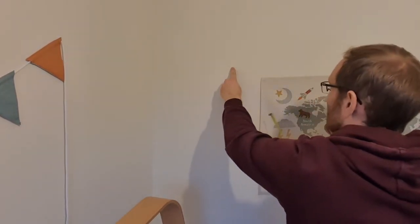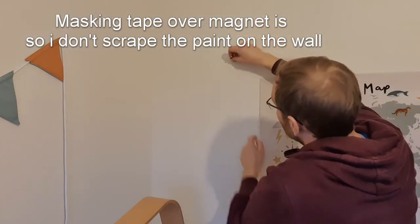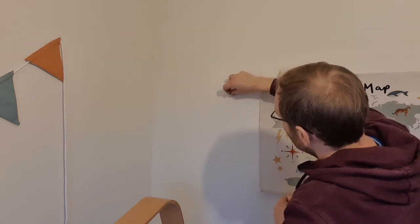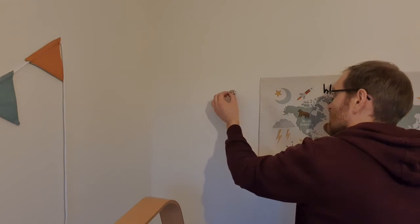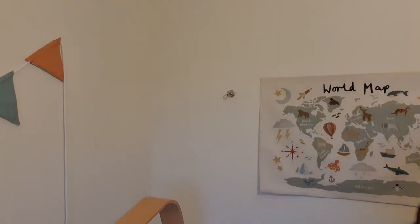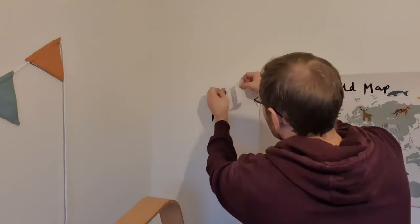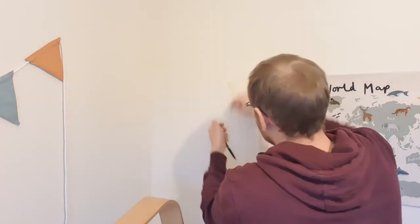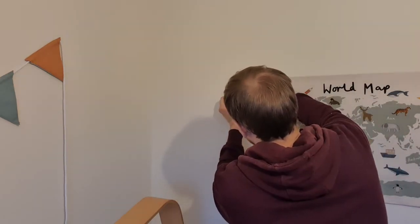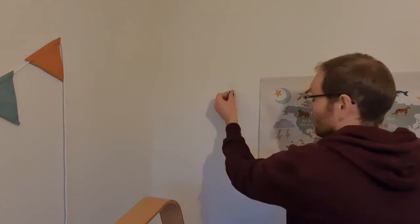With a small piece of tape on the magnet, move it back and forth over the area until you feel the magnet pull — and there we go, that's a pull right there. Then get another piece of masking tape, put it over that spot, and at the strongest point just mark it. Then continue down the wall.